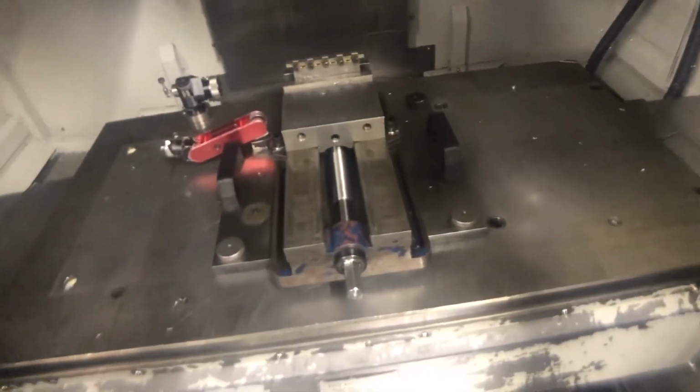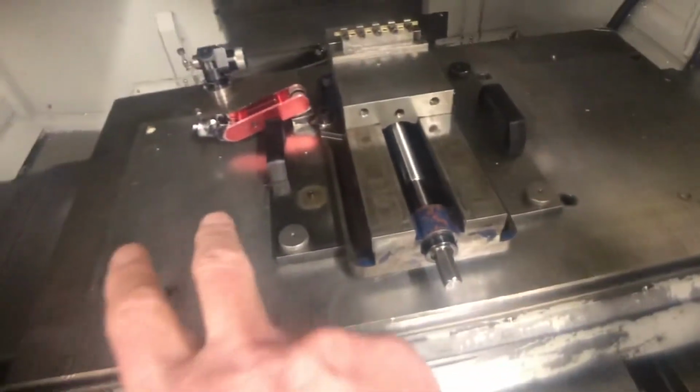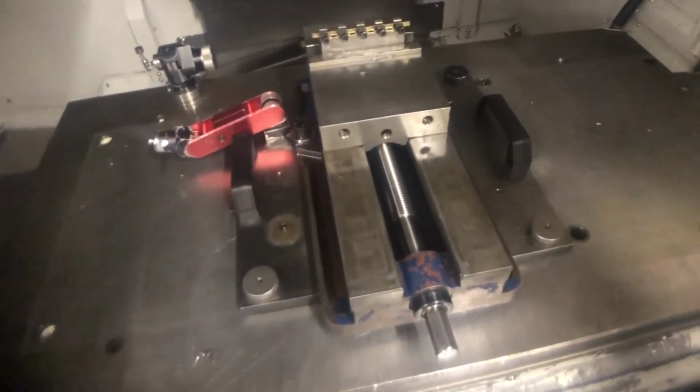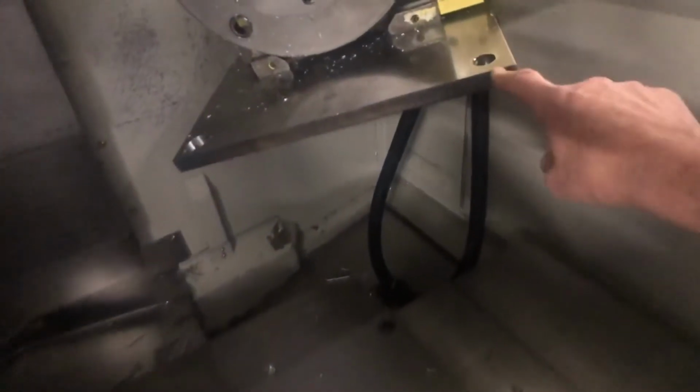This is inside one of the verticals, and we've just got a conventional vise on here, and like you can see, it's held down with 4 ball locks. So these ball locks, there's a position here, there's a hole there, there'll be a hole underneath there, there's a hole there, hole there. So on this one table we can have 3 of these sub tables in 3 positions. As you can see, this is a 4 axis, and it's got a sub table on, so we can just drop that straight on to here, and it drops straight onto them 4 ball lock positions.